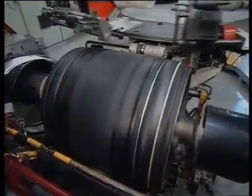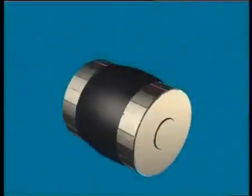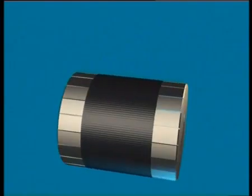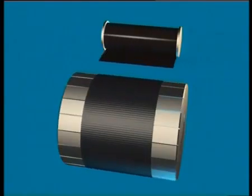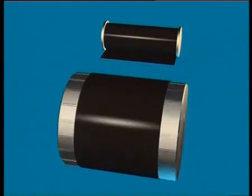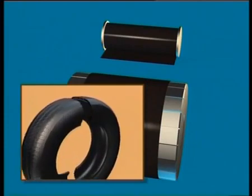Long lengths of metal and synthetic cable are also used. Manufacture is performed on the drum, a rotating cylinder whose central flexible section can be inflated for reasons which we will see later. The first element applied to the drum is a sheet of airtight synthetic rubber. This layer replaces the inner tube in today's tyres.